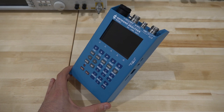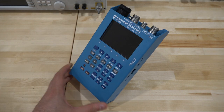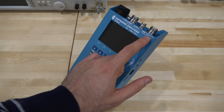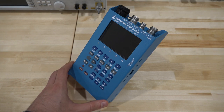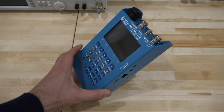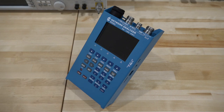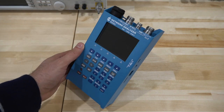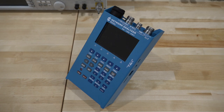This particular unit is pretty interesting. It's low cost — about $2,000 — and for a 9 kHz to 6.8 GHz network analyzer, it's fairly reasonably priced. Now, even though it's a two-port network analyzer, you can only do S21 and S11 measurements on this unit. But it also can act as a spectrum analyzer, as well as a synthesizer. It has a low frequency output close to 0 Hz, plus Ethernet, SD card, USB — pretty nice overall. We'll do a full review, teardown, and experiments.